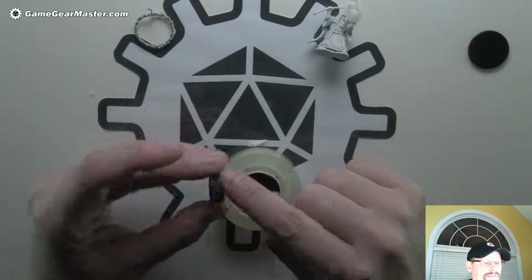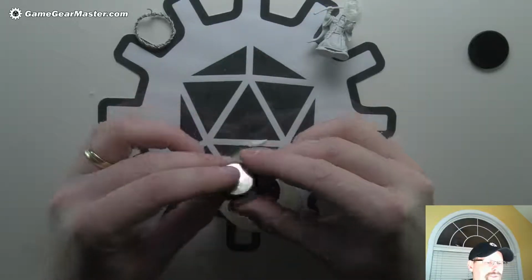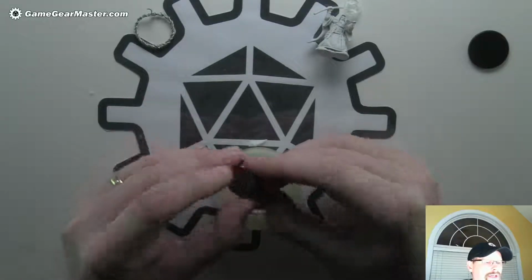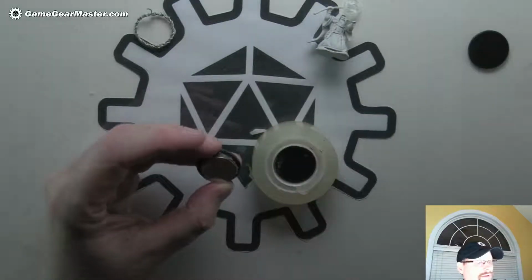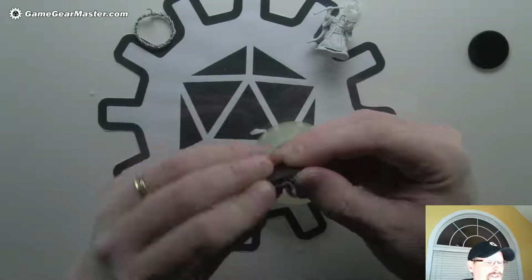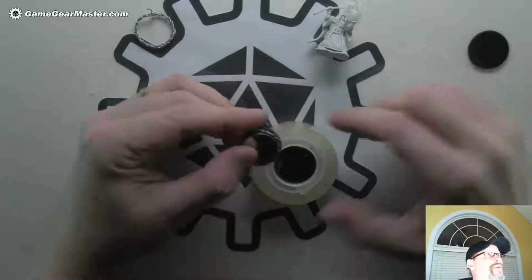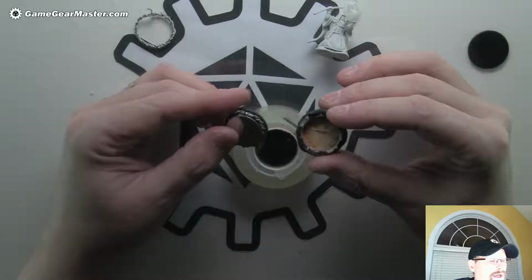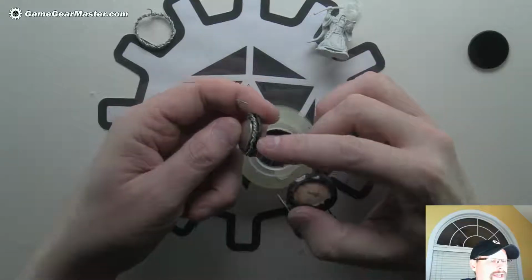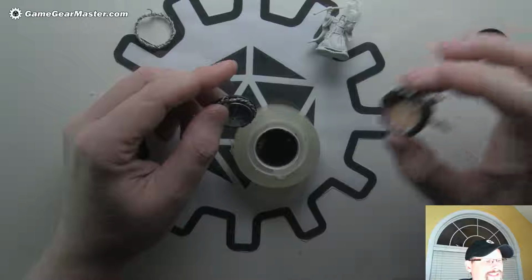Now this looks a little messy because I've used it a few times, but it's got a battery glued on top of 1 sheet of cardboard and on top of this mini base. And this will define where our little coil will sit in our mold. Kind of like this. So this ensures that that little coil piece is at the right depth to hold the battery in place in our compartment when we actually build it. This is going to be pointing down like this.